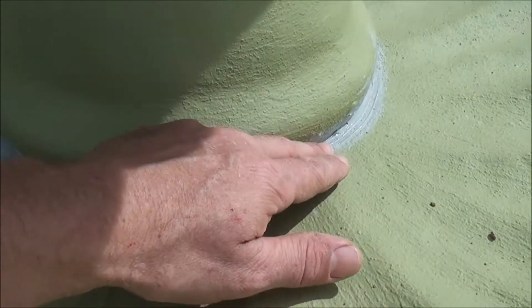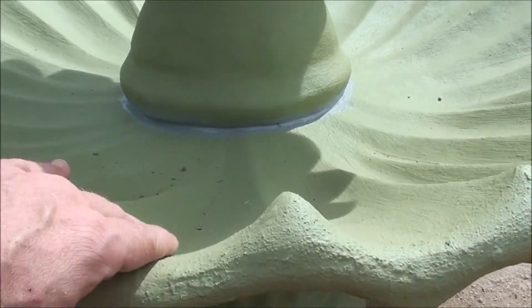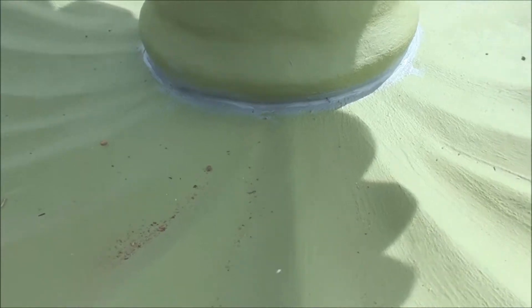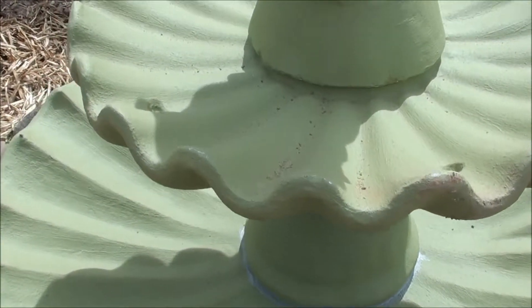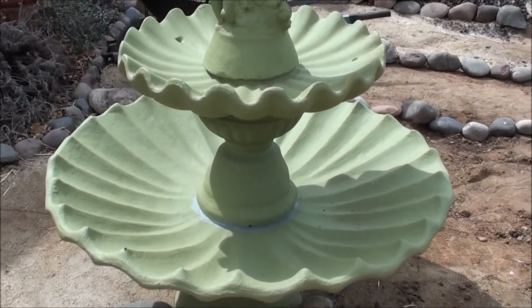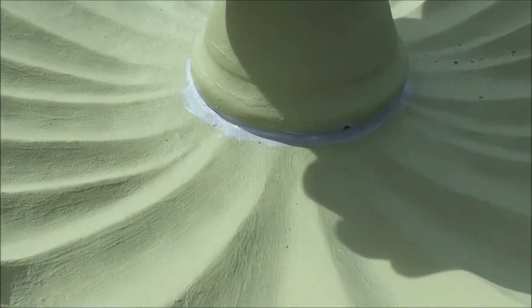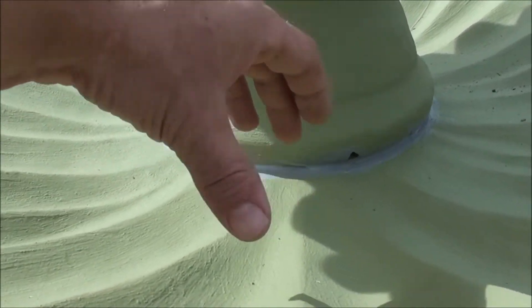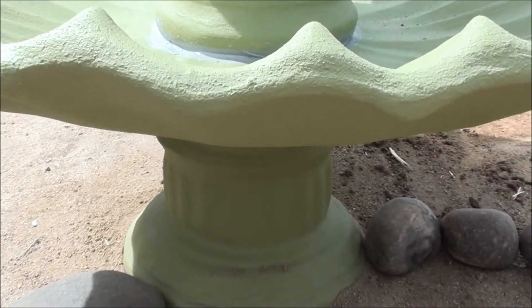It's all fixed up now. I've got a couple little touch-up paint spots to do, but what I did was get some sealer crack filler — I can't even spot where it was, but it had a pretty good crack line going down and around. So I filled that up, scrubbed it with a couple of wire brushes. There's a product called UGL — it's kind of like a Portland cement mix in a little paint can. You don't want a brush, you want a mitt — like a mop-mitt roller glove — and you just dump it out and rub a coat on there.